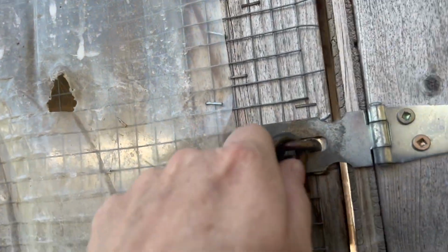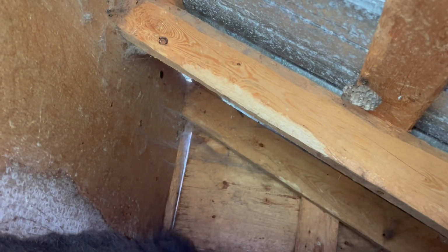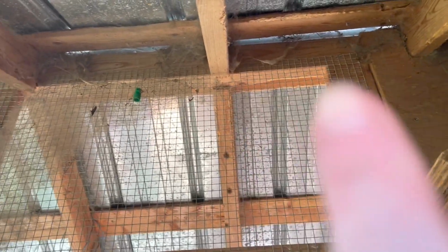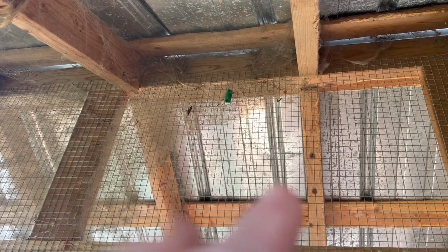My husband would also have made 8 up in there. In here, our trusses are 1, 2, 3, 4, 5, 6, 7, 8. So the bottom amount equals the top amount. And then in the middle, we have the dividers. If you look, there's a 2x4 straight down the whole middle as well. And then we angled those to go into the main 2x4. So that's how we made our trusses.